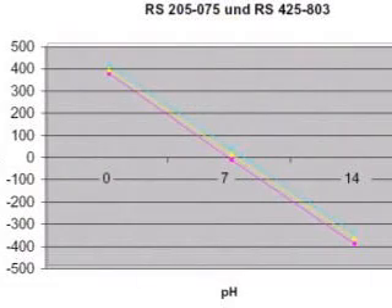We have chosen an RS probe with the code 425803. The manufacturer gives us the characteristic line, and as we can see in the figure, the signal generated by the probe will never exceed 500 millivolts. So we will have these limits as the input range of the input stage. Considering a value a bit higher than the highest the input can show has advantages: any value from the probe will never exceed the limits, and we will avoid the linearity error close to the limits of the range distorting the measure.